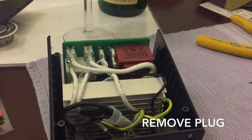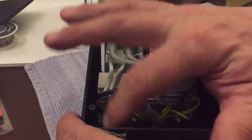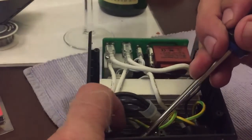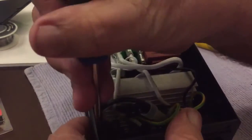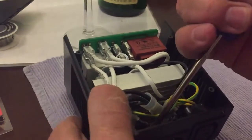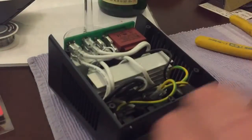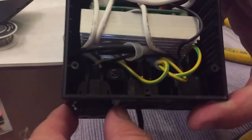I'll show you how to remove this little connector that's inside. There's a big old cobweb inside of there, sorry about that. So this is a snap-in connector. It's got some little flanges inside of there. I couldn't get a good shot with my camera, but this is probably one of the harder parts — it just takes manipulation. I was able to get one of them out using a vise grip. This one came out with just a screwdriver.